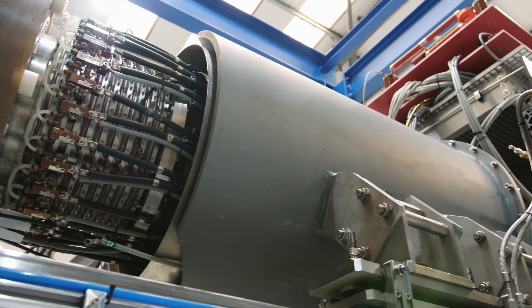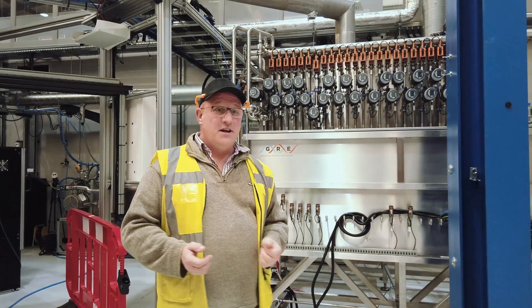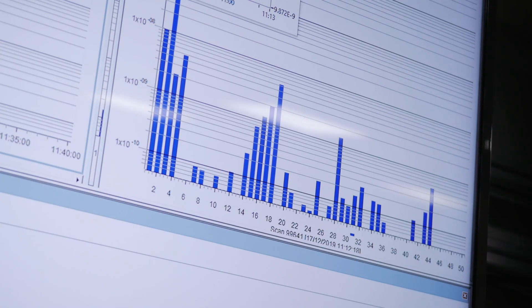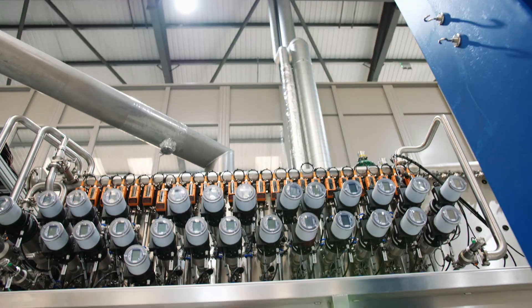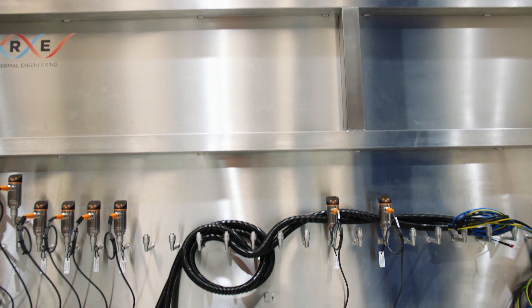Now we're going up to a hundred million, we need something a bit more serious. And liquid nitrogen is what we've chosen to use. But in order to do that, we need to know just how much we need to cool it by. The information we took from the 15 million campaign has now been transposed — and it's not just scaling linearly. The hotter the coils get, the more heat they produce. So we need something serious, something with a lot of oomph. And liquid nitrogen is what will do it.